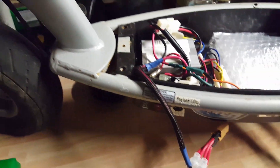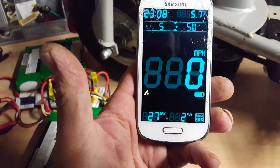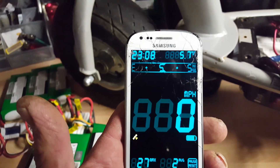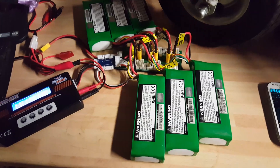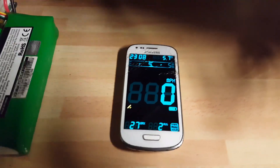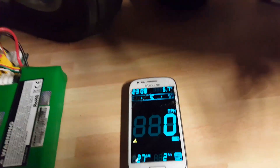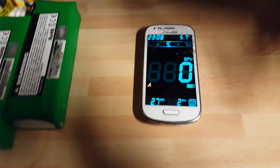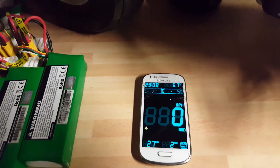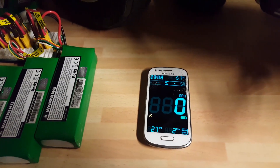I've done a speed test so far, just a quick one, and the results are 27 miles per hour. We've done about five or six miles, and I'm just charging the six lipos to give it a proper speed test — see if we can get 30 miles an hour out of it. This was at about 3.85 volts per cell, so in theory if we can bring it up to 4.1 or 4.15 volts we might be able to get 30 miles an hour. We should be doing another speed test run tomorrow, hopefully not quite as windy as the last one.